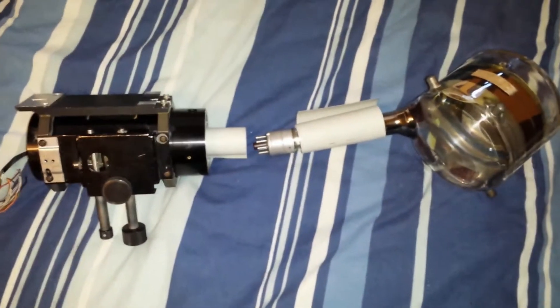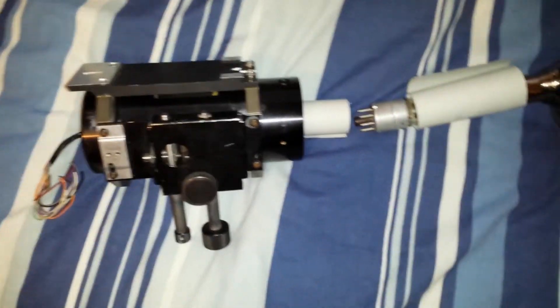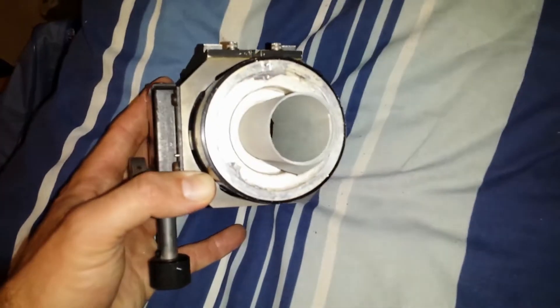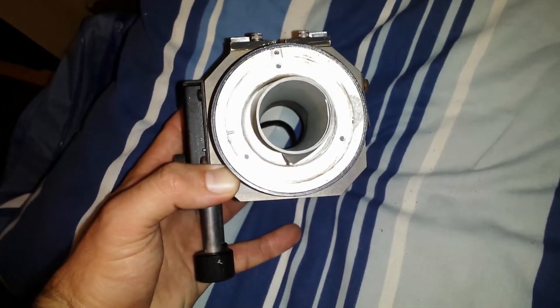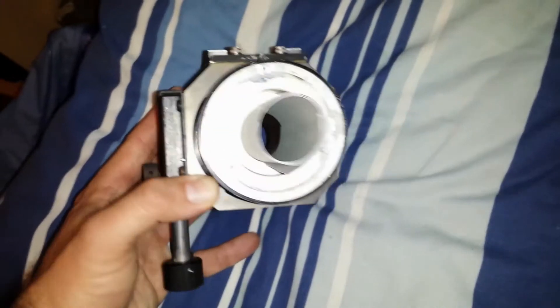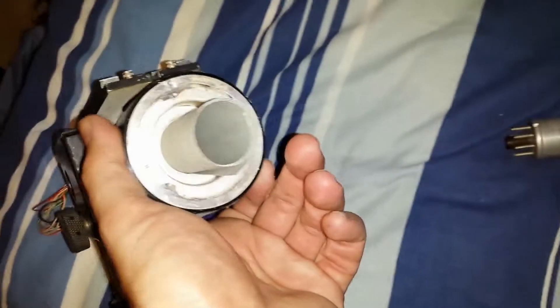Basically in this video I'm talking about how I'm going to fit this iconoscope tube inside this yoke. The tube will actually fit in easily, but too easily — the yoke is a bit wider by about a few millimeters, so it would be a very loose fit. To remedy that issue I sawed to roll some cardboard paper to make the tube fit more snugly.